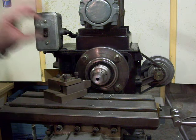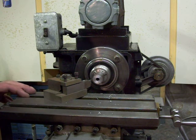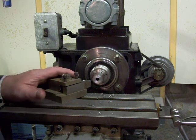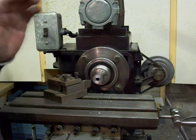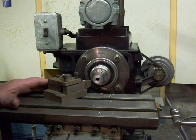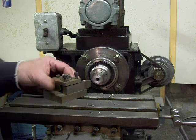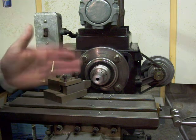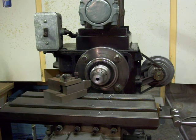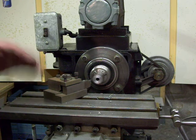Hello everyone, we're back playing with the engine mill and I wanted to show you just how versatile the machine is. I have a small turning job here that needs to be done and with the 5C collets, anything that's the correct size you can use as a chuck to hold your work. I haven't made a proper tool post for this machine yet — this is just a piece of scrap from another job — but anything you can bolt to the table to hold your tool, you're set to go.